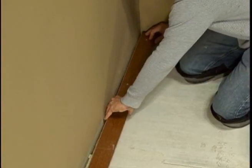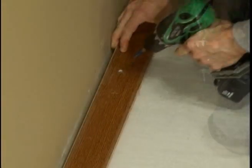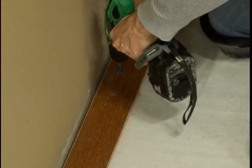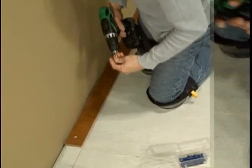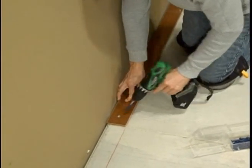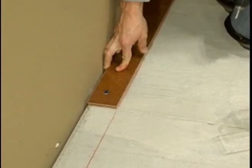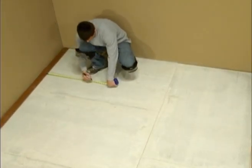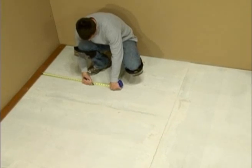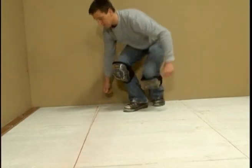Next, install a backer board to the working line to hold the boards in place as you push against them. Many installers use the actual flooring, provided there's enough available, and screw or nail it tightly in place. This allows you to slip the tongue of the first row of boards into the groove of the backer board, since most engineered flooring is installed with the tongue facing the starting wall. We also recommend snapping a reference line at the point you'll want to finish spreading your adhesive, about as far as you can comfortably reach. In this example, we'll spread our adhesive back about one-quarter inch shy of eight board widths, or twenty-three and three-quarter inches.